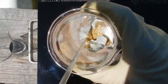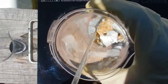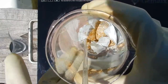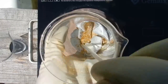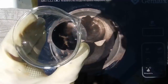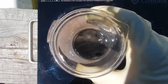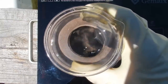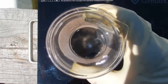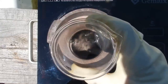Transferred to a beaker. Here is the gilding — it's already dried up. There are a lot of impurities here, so there is no point in melting it right away. We need to dissolve it in aqua regia and then precipitate pure gold. Now I'll also show you what I managed to take from the solder solvent — this is a dust of gold. After settling, I treated it with nitric acid. The solder also contained a small amount of silver. And here is the gold — I'll upload everything together.